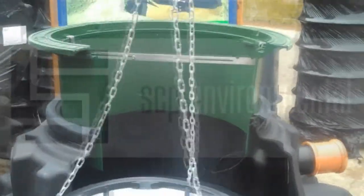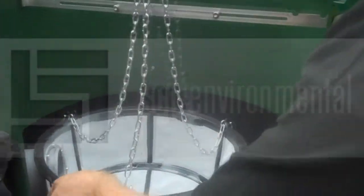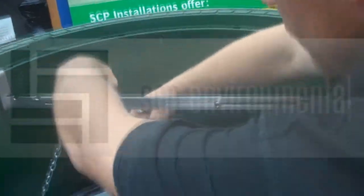The complete filter needs to be hung from the bracket, which we'll show you in a minute. First of all we just put in the inlet pipe, so this goes from the outside in, pushed right in as shown. We then get the filter basket, level the inlet up with the hole in the basket, and then hang from the bracket accordingly.